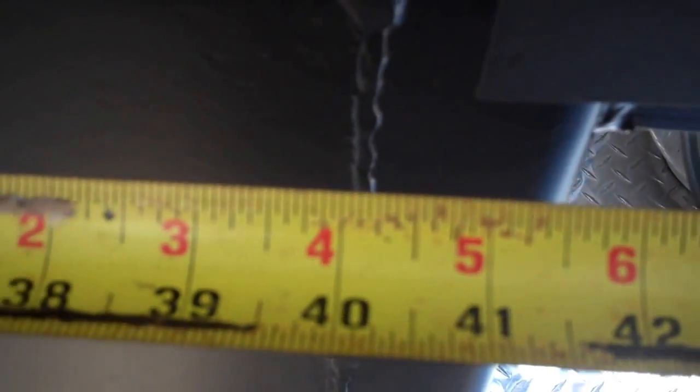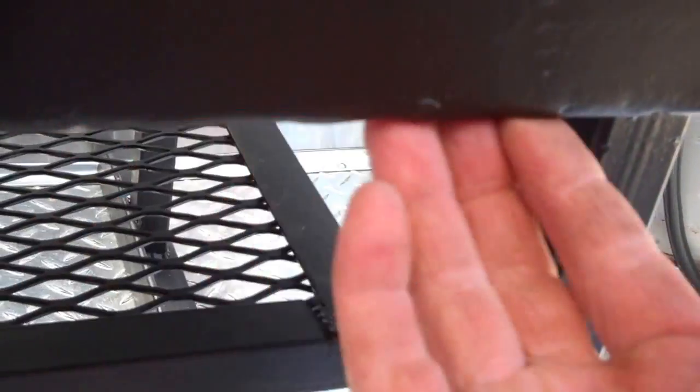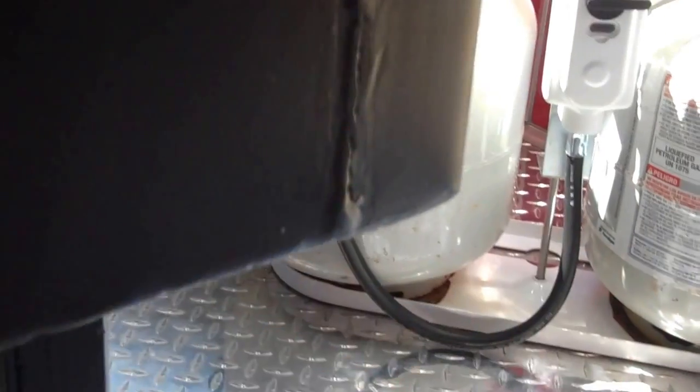This is where I started, 2 inch. Now they got this piece, which goes all the way across the front. And the width of it is 40 inches. And they welded a bottom onto it here to cap it off. And this front piece goes up and goes in. It's about 1.25 inches, but I'm sure it's 1 inch bend. Same with the top. They filled it in up here with a 2 inch by 1 inch bend, and it goes from side to side.